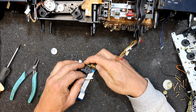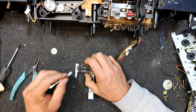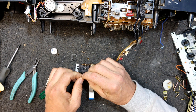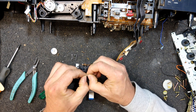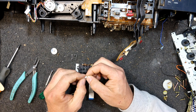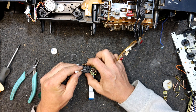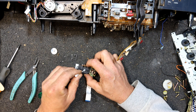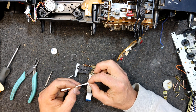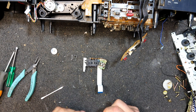You've got to be careful because it's on a little flimsy ribbon cable thing. Now can I, I'm going to have to rip off a little bit of cotton bud or something and poke it down there. I don't like the idea of putting a screwdriver in there. I don't like putting too much of this down there because it's not going to come out again. Maybe if I ripped all that off there, can I get that bit down there? No. It's kind of going, but is that deep enough? Don't think so. It's way down there. Let's re-soak that in metho, but not too much.